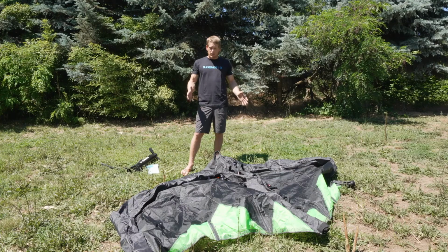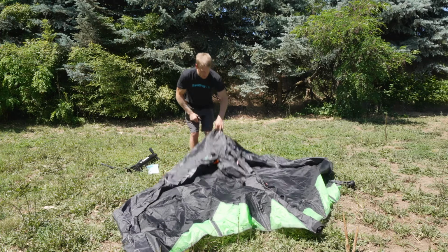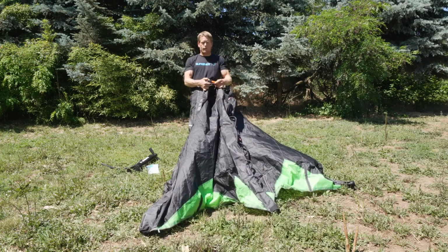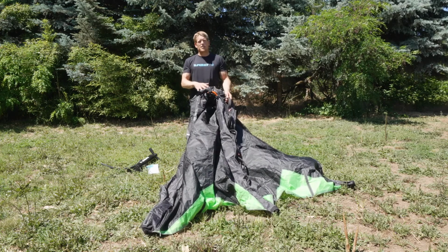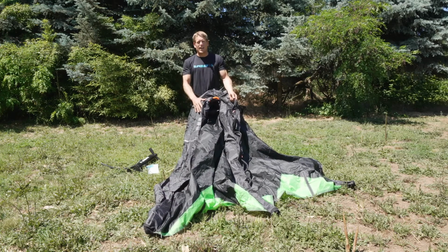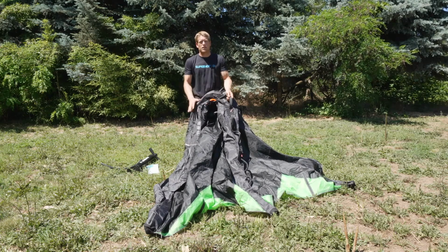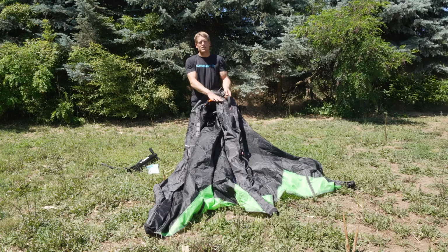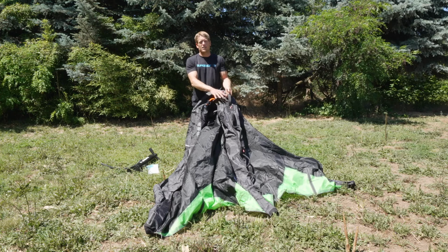So the first step when assessing a leaky bladder or leaky wing system is to find out where the leak is. The easiest way to do that is to pump up the wing. You're going to clip off the one pump isolation strut valve, and then let the wing sit for about 45 minutes. What you're going to try to do is figure out whether the leading edge got soft or the strut got soft, and that's going to give you an indication of where the leak is. In this case, I've already performed this and I saw that the leak is coming from the strut, so we're going to pull the strut out and assess it for damage.